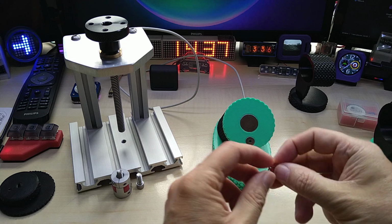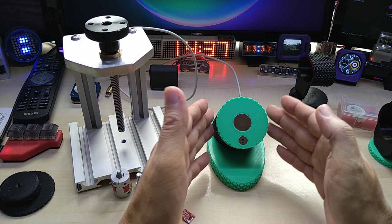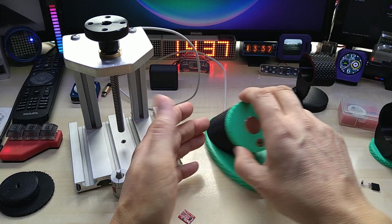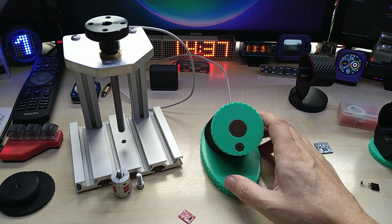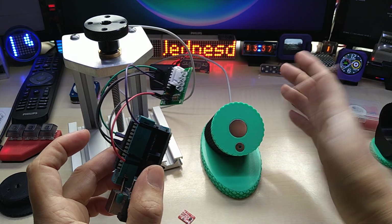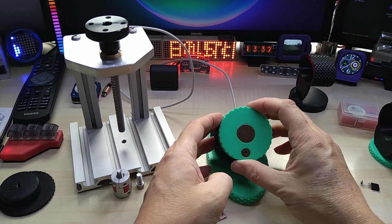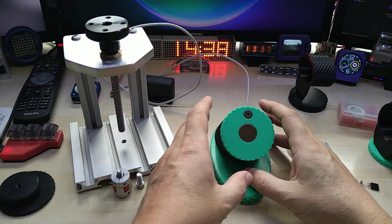Oh, here I have it in front of me. Obviously this one just plugs in right now and it would run 24/7. Although in the code I can set it so it makes 3 turns, clockwise, counterclockwise 3 times, and then it can sleep. And while it's sleeping, I'm also taking power off of the motor, because normally on steppers one winding is always powered on even if it's not moving, and it just generates heat and uses electricity. Not that it's much, like 200, 250 milliamps, not that it would bother it, but it has a gear in here, even though you can turn it with your hand, and you can hardly hear it.